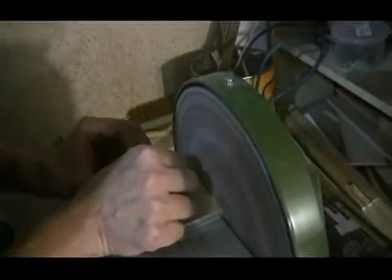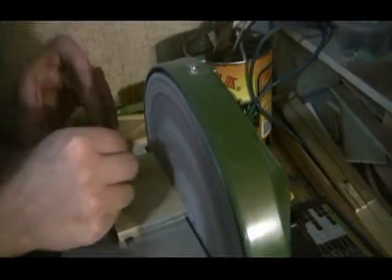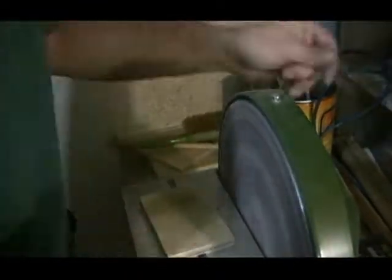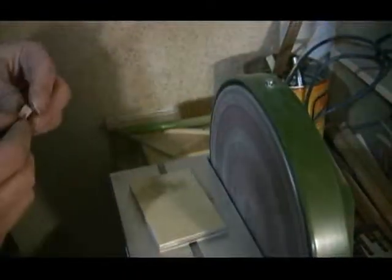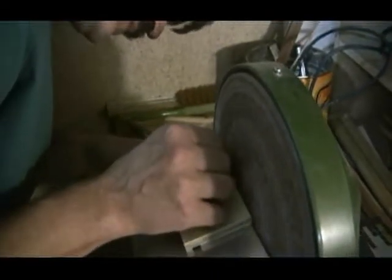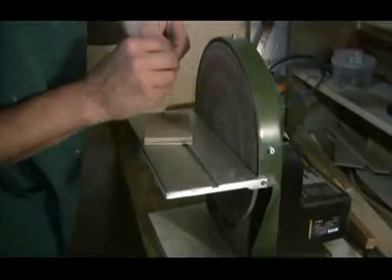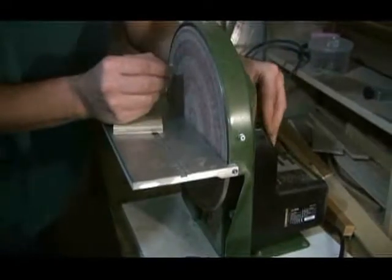If you get a small wood split or just an angle that isn't perfectly 90 degrees when it comes off the saw, because that can happen, if you grind the edge a bit, trim it up on the disc sander. That's what's happened with one of our pieces. Now we're going to cut a wedge shape into that. So he's angling. It's very small. It's not important.